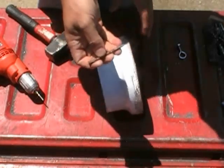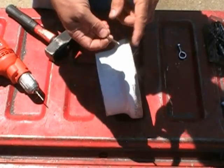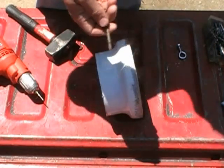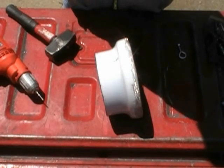My punch is nothing but a mason's nail or a concrete nail, because this stuff is extremely hard steel, and you can grind these things to a nice hard point on a grinder, and if you lose it, you're not out any money. So these things are really good for using for punches. Alright, let's get started with the drilling. I'm going to pause out here.